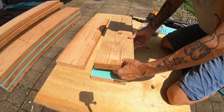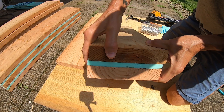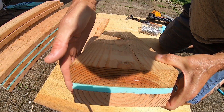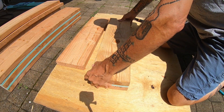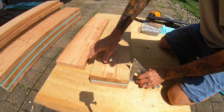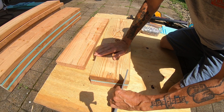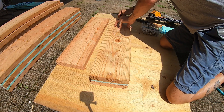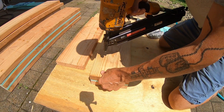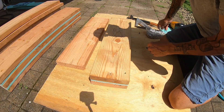Put the foam in place and set the next piece on top. For a good assembly, you don't want your boards going together misaligned — you want them nice and square and flush on all sides. Get yourself a speed square, butt it up against the board, and check all three directions. Sometimes with dimensional lumber everything isn't perfect. I've got three-and-a-quarter inch nails here. I'm going to pin one corner, checking each side carefully — I still have to be cautious with my right arm from the shoulder surgery and can't go too crazy with the air nailer.